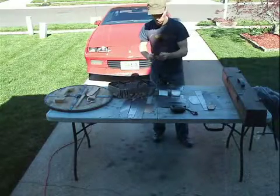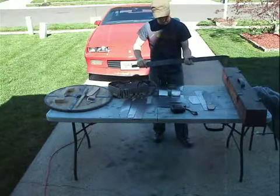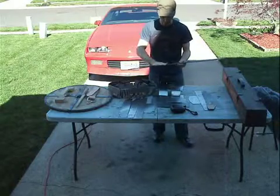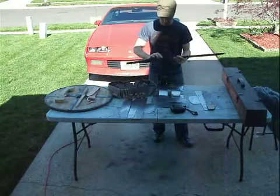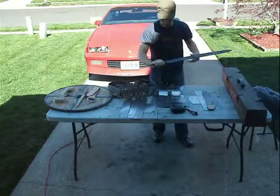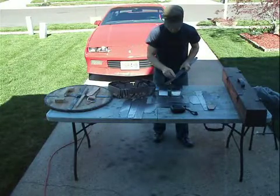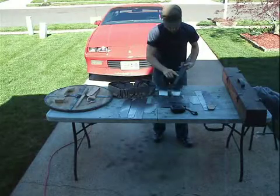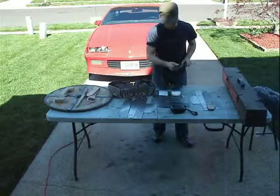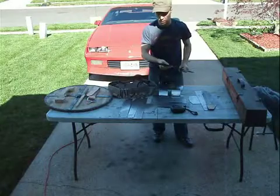And as you can see, the Viking style period sword. This is the one I started. I wasn't paying attention towards the end when I was pulling out the tang, and then when I was hammering out the back part here, I made this too thin. That, and I had to re-weld a new handle, and it did not work out when I forge welded. I got these inclusions on the other side. This side welded in nice and meshed, and then this didn't. So I think the structural integrity of that is pretty much gone.